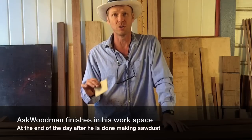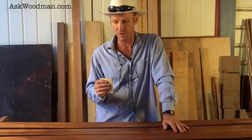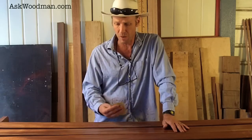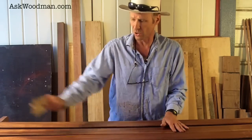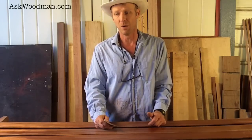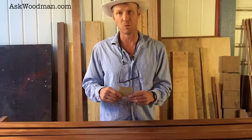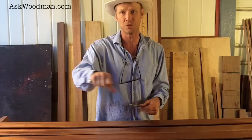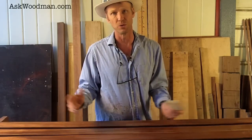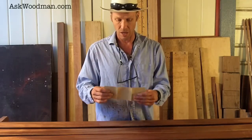Using this low-tech technique you can finish in your work area and produce a really quality finish without needing a dedicated spray room or finish room. Waterlox is a very forgiving finish — if you get a bad run, a drip, or you missed a spot, it takes nothing to just come in and scratch it and float it out, and the next coat will make it just disappear. Sometimes it may take two coats, but there are times where I'll come in with an electric sander on tabletops, using 320 no-load paper in my half-sheet sander with the power cut way down, and it does a beautiful job quickly.